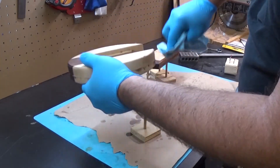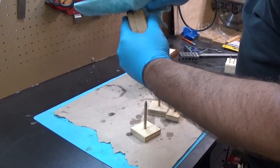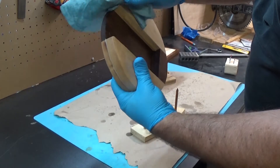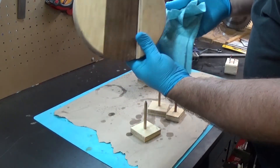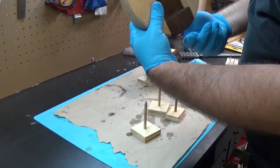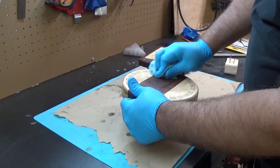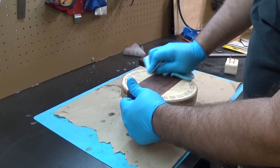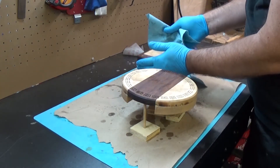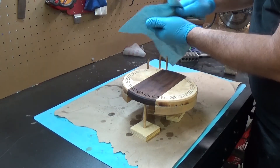I've always been happy with just one coat unless I'm really trying to stain something darker. For example, I made barn doors for a guy one time — it was cheaper to make them out of birch plywood but he wanted them to look like walnut, so I wound up putting about three or four coats of dark walnut stain on them. But when you just want the grain to pop, one coat seems to do the job.